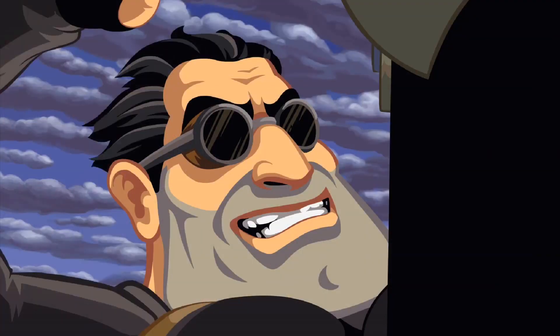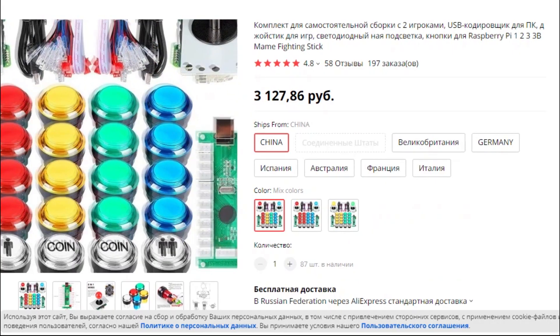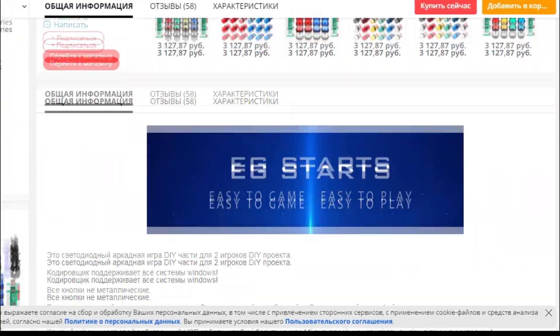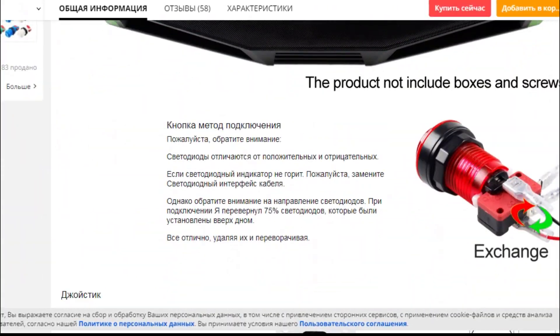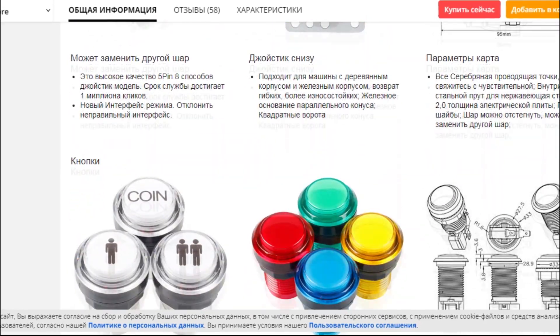We also get heatsinks and a good power supply stably delivering 3 amps. On the Raspberry Pi 4, PlayStation and Nintendo 64 games should already run, and even PC games through DOSBox or QEMU. In addition to the Raspberry Pi, we order a set of arcade buttons from AliExpress. I got the version with backlit buttons, and they're multicolored. But really it's only a matter of design, taste, and budget — there are many varieties. Almost all buttons have a 24mm mounting diameter, so the holes we drilled in the wooden panel should fit perfectly.